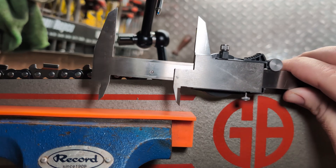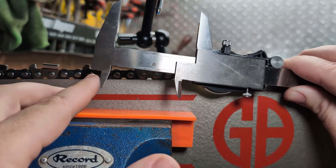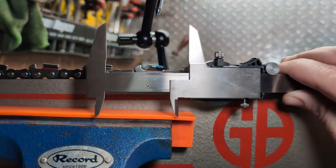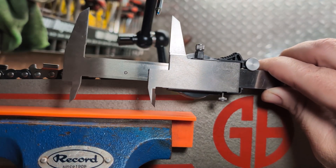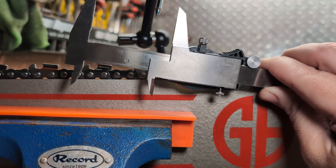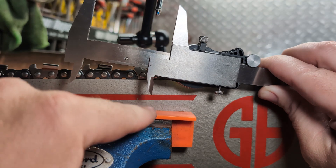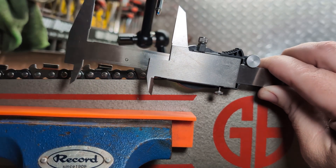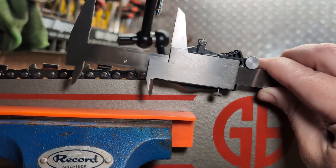To give a very basic example of this, imagine the two points down here as different ends of the cutter — that's it when it's new, that's it when it's old. My thumb and finger back here are the pivot point, which is that rear rivet. If I put a certain amount of input into this, you can see this end has raised further than this end. That's what you're trying to compensate for — that's what Carlton's theory was on, just the basic leverage of that.